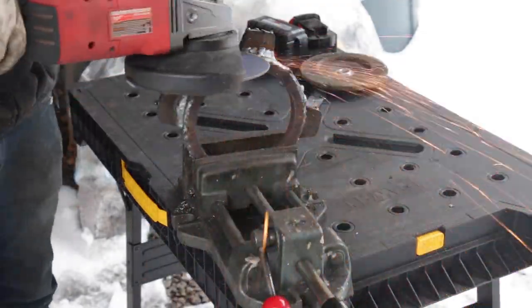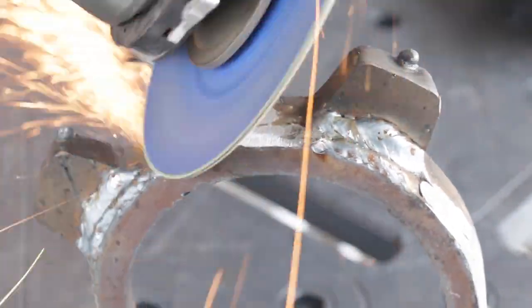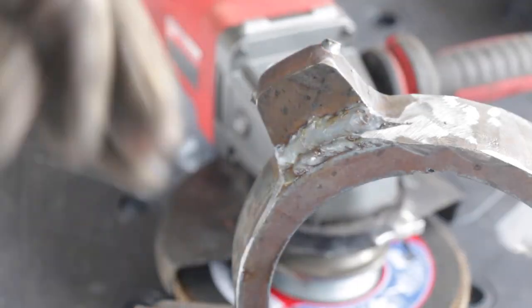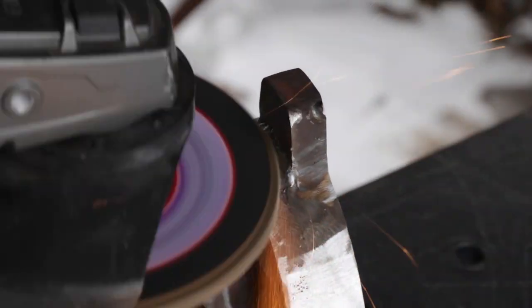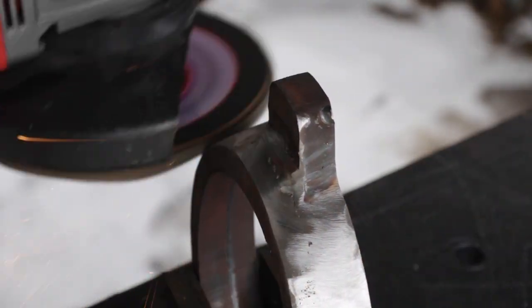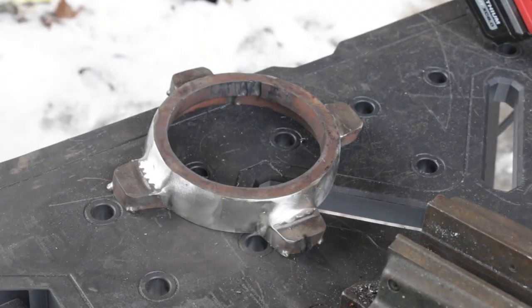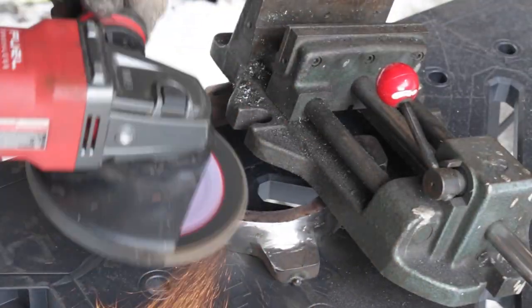Back outside with the Victo Grain disc — I'm also using a 7-inch cordless grinder from Milwaukee here, which just tears through material that much faster. It's big and wears on you if you use it all day, but it's so much faster and more effective than a 4 or 5-inch grinder. You can see as I weld and blend in these corners that the pieces are basically meshing together and becoming pretty seamless. I'm using the nose of a flap disc to blend in that corner and get this thing looking that much closer to finished.